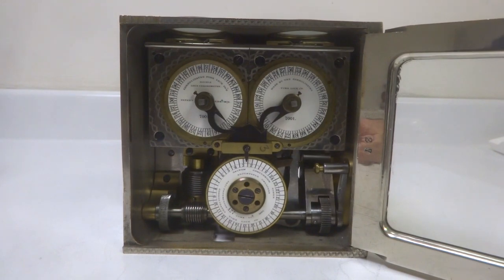The purpose of the concussion unit was that it would serve as an override of the time locks in the unlikely event that both movements would fail. Overrides were common on time locks, especially those made by the Consolidated Company if they had only one time lock movement. You would then have a special override method which Consolidated called the Infallible System, illustrated on other examples in the collection. Here you have an override in case both timers fail, which is itself a very unlikely probability.